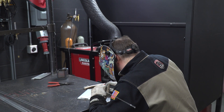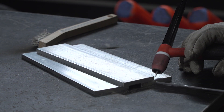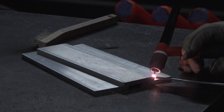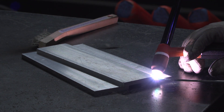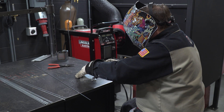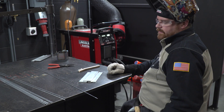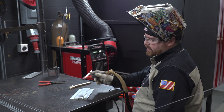The fill rod I'm using is ER 4043 and the base metal I'm welding is 6061 T6. Sometimes the arc is a little bit harder to start with helium, and that's simply because helium requires higher ionization voltage to ionize. With helium you'll end up running about 22 to 25 volts, whereas with argon you're running about 9 to 12 volts.